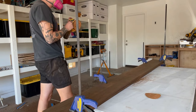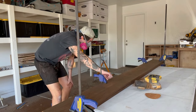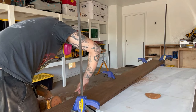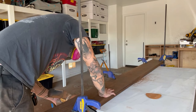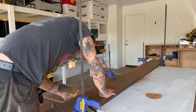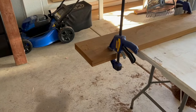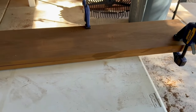I clamped them together in the best position I could, threw on some 80-grit sandpaper at a high variable speed on my sander, and basically went around all four edges sanding any loose overhangs from one board to the other so that once I was done, both boards lined up perfectly. This was important because these shelves are going to be stacked one on top of the other — I just need to make sure they're exactly the same dimension so that when one is stacked on the other it looks like they came together with the same profile.